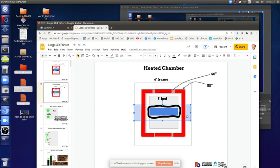Yeah, so admissible materials are high temperature plastics. What do we have on hand? PEI, we have polycarbonate. We don't have PEI that's 2x6, we have 1x2. So with a 1x2, we can only do 6 inches by 12 inches per print bed, and we can try that maybe as the first step, because the large sheet is going to get into the issues of the whole geometry and aligning things. We should probably try as V1 a 1x2 sheet of PEI, and then we end up with a 6x12 print area, which is still a major success.